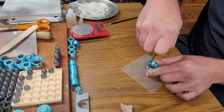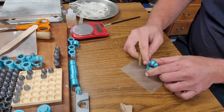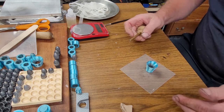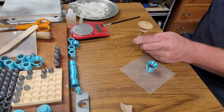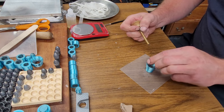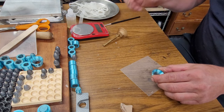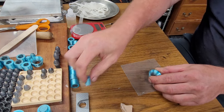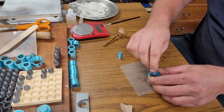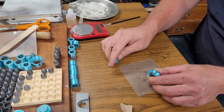And this part of the process is when the original factory in Philadelphia exploded. The way they made them was they had a brass mold with like 24 or 25 holes. They would dump it in and spread it out. And then they would take a hammer and a mallet with an iron bar and hit each one to compress it. And from hitting it, the friction built up and caused an explosion in the molding room. And that caused a chain reaction, which went throughout the factory and blew the whole thing up. I think it killed like 78 people. Most of them were young women in the factory. It's an interesting story. Look it up. That's probably what made this cartridge famous, the factory blowing up.